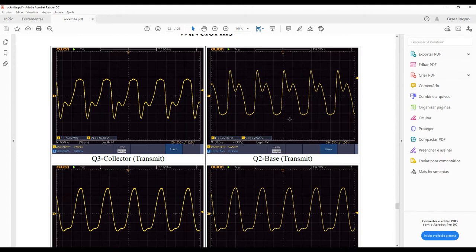What we are doing with this equipment is to provide DDS, so you can select the transmitting frequency in the proper range. I will explain you later, and you can also select the receiving frequency. It's very common. It's very nice to have this possibility. So we will just replace, we will just delete the oscillator part of this circuit.